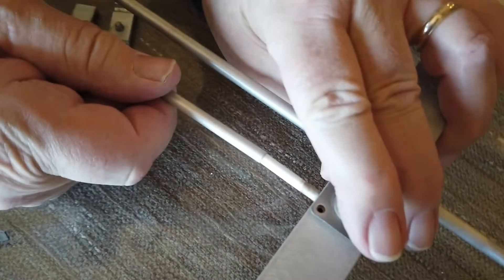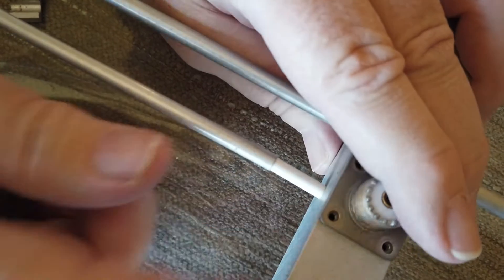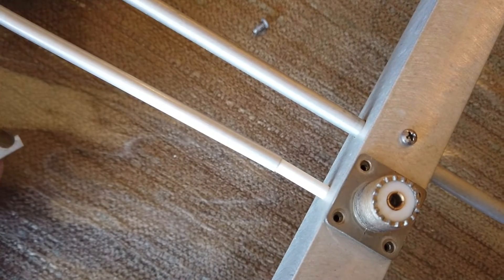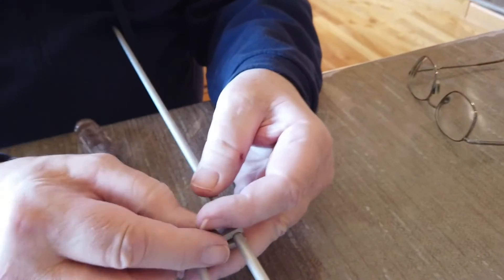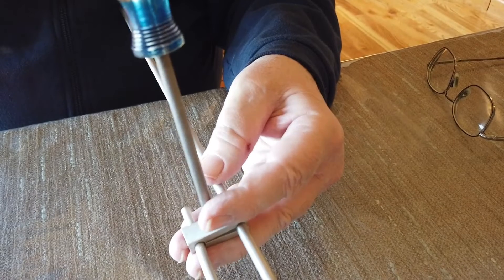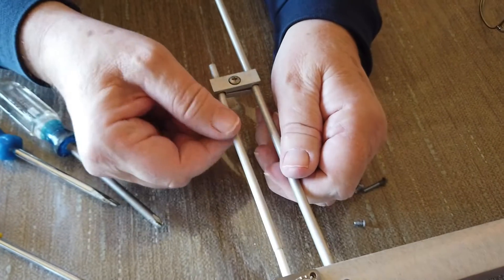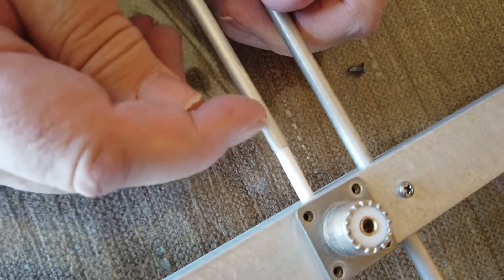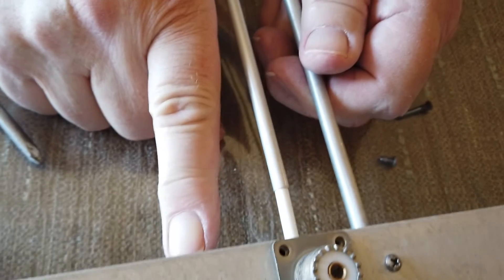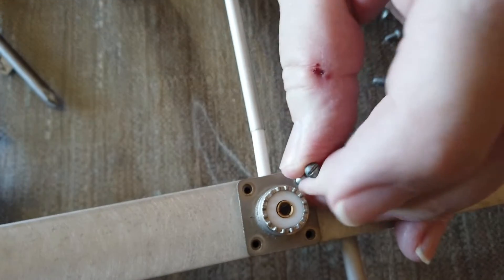We're going to put this in here, and this tube is going to go slightly in here so it acts as an insulator so that the center does not short to the mast. Then we've got this clamp right here. We can tell where it was because the clamp has made that a different color. You adjust it two ways: you adjust the length of space between the start and where it goes into the insulator. You do not want to press this element all the way against the mast because this is hot and this is ground.